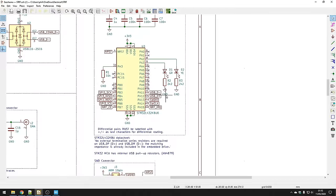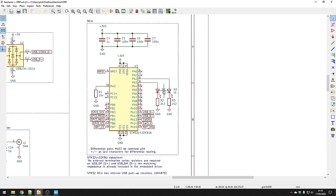The next section is the STM32. This is taking information from the datasheet and application notes provided by ST and making a schematic from it. The pinout is transferred from CubeMX — I've labelled all the pins using global labels. I use one decoupling capacitor of 100nF per VDD pin, so I have three 100nF capacitors. I also tend to put one bulk decoupling capacitor fairly close to the chip itself — in this case a 1 microfarad capacitor.